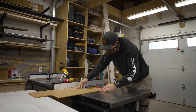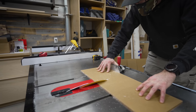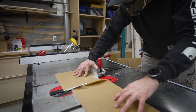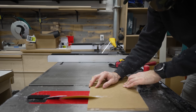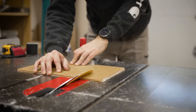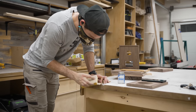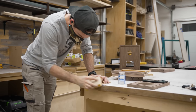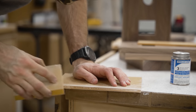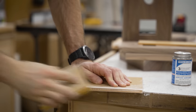Let's talk cutting acrylic, because it's actually really easy — it cuts just like hardwood. A fine finishing blade will give you a nice smooth cut with no chips and tear out. One thing you do want to note is that P95 acrylic only has its frosted texture on one side, so if you want everything to look consistent you've got to make sure you keep track of which side is which. As a final step, I sanded the acrylic with a fine grit sandpaper to remove any tooling marks and to make the edges nice and smooth. Be careful — I did slice my finger open pretty good on the sharp, polished, edged acrylic.